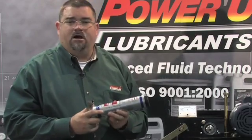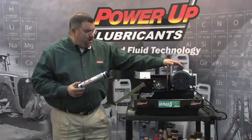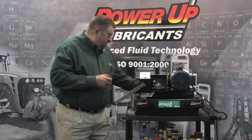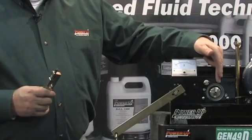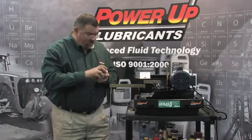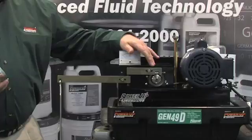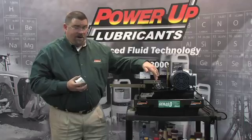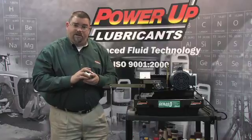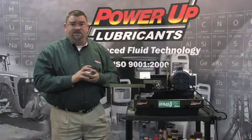Now this grease has an OK Timken rating of 100 pounds. I've explained in an earlier segment that this is a modified version of the OK Timken load test, and this actual machine that we're going to test this grease on was designed for testing greases. We're going to take this case hardened Timken roller bearing and a case hardened race. These are one pound weights, and for every weight we put on here, we've got a fulcrum advantage of 35 to 1, so every one pound is like putting 35 pounds of pressure on that bearing per square inch. We're running on the size of a pinhead, and the engineers at the Marin Laboratory tell me that on a new contact area on that race and bearing, these weights can actually represent over 7,000 pounds of pressure per square inch. So it doesn't take a lot of weight to get this bearing to seize up.